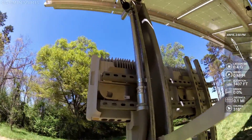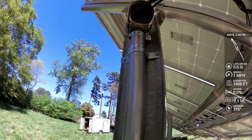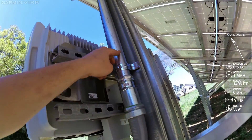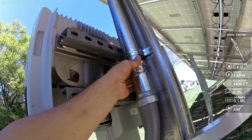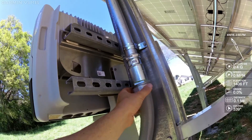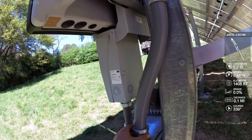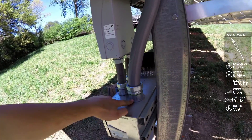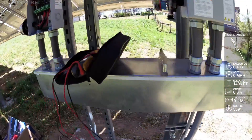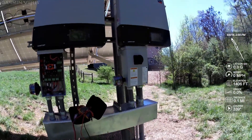This is more tips. This is metal flex, an EMT terminal adapter, rigid coupler, liquid tight one-and-a-half inch, metal flex terminal adapter — the cool guys call them TAs — another terminal adapter, into a Meyer's hub, into an exterior 6x6x3 electrical wiring trough, NEMA 3R.